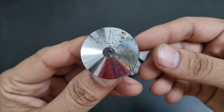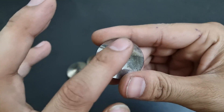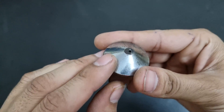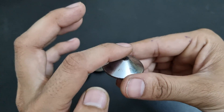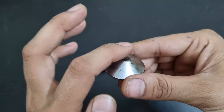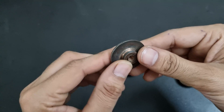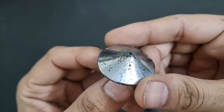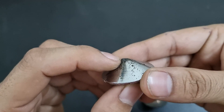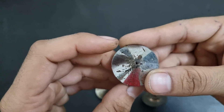The first nozzle has a damaged tip. The customer also rubbed the tip to try to clean it, but you can see the straightness of the tip is gone. If the straightness of the tip is gone, the nozzle is also gone — this nozzle is damaged. On the second nozzle you can see there is a metal deposition on the tip, and this deposition damages the nozzle.